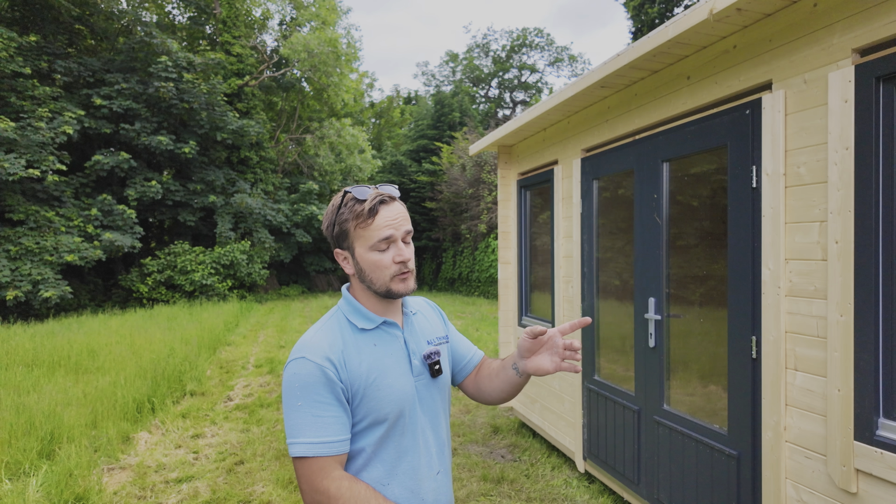And this is where, when I said to you, I like it all to be the same in a horizontal line, I'm going to copy my pencil marks on both sides, so that when you look at the windows, yes, you're going to see exposed screws unless you want to fill them. We've got a knot here, so I'm going to come slightly down. No choice. Pencil mark there, pencil mark there, and they are ready to be put on the other window.